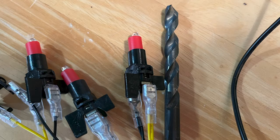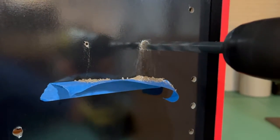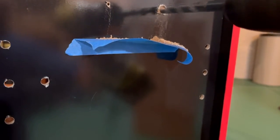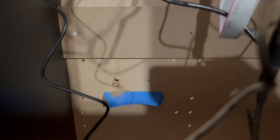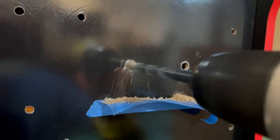Next I used a 3/8-inch drill bit to make the holes for the LEDs. The cabinet's kick plate is made from MDF and its back surface will tear badly if the hole is drilled straight through with the 3/8-inch bit. To prevent this, I drilled each hole halfway through from one side first. I then used the pilot hole on the back to align the bit and drill the rest of the way through. This results in a hole with clean edges most of the time, unless, as shown on my X-Men cabinet, there's also a layer of vinyl over the MDF. With the drilling done, I folded the masking tape over on itself to lock the sawdust in and then peeled it off the kick plate.